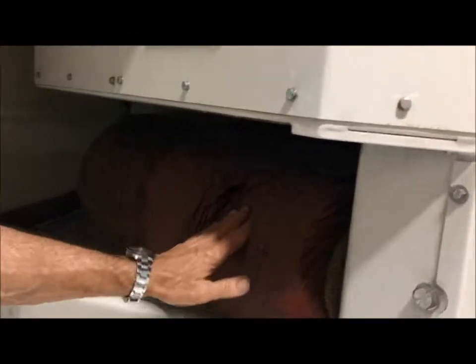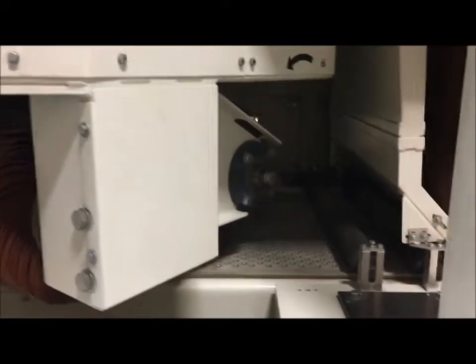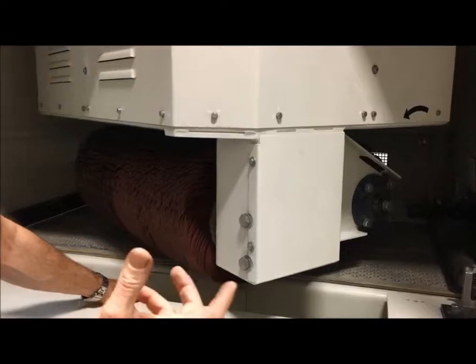Then we have a machine here, and that's the second good way to edge round parts. Again, it has a wide head sander in the front, but it doesn't need to remove dross or grain. For you that's irrelevant, but it has a rotor. And these spin obviously and give you some edge rounding, and then this whole carousel rotates so that they come from all directions, and it works over a vacuum belt. This works good for parts down to postcard size, and if they don't have any openings, because you need to hold the parts down with a vacuum.